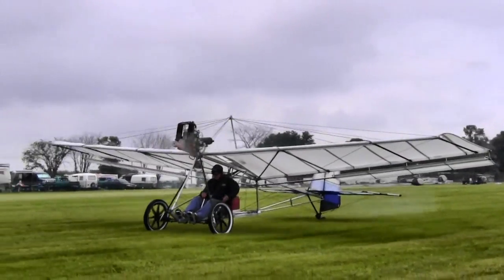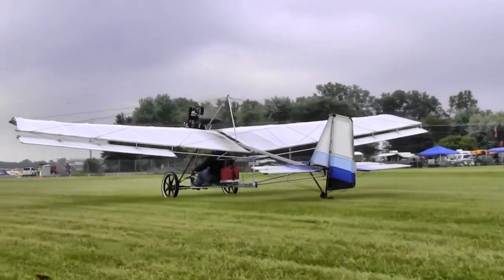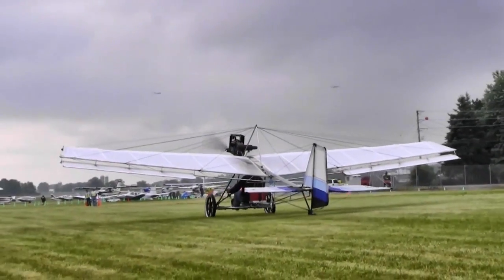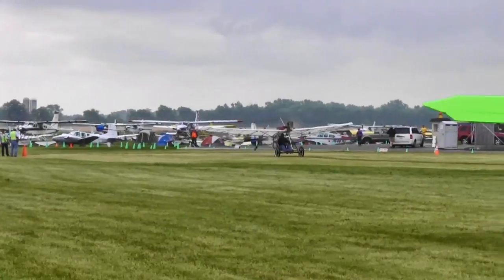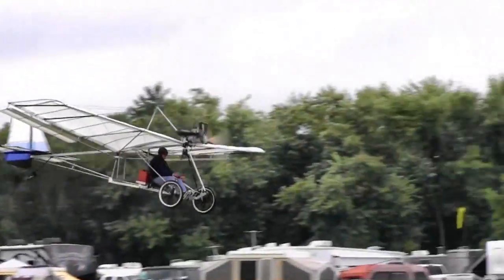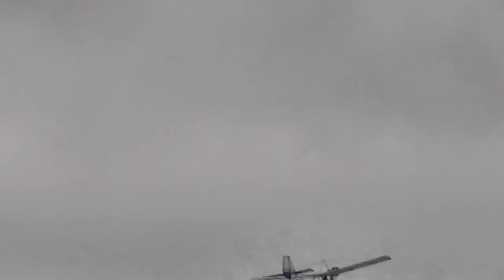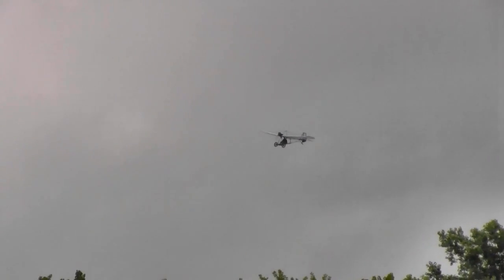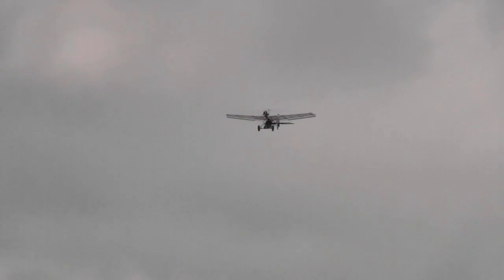You've also got these big, almost motorcycle-style wheels. Actually those are Skyways — I get them from Niagara Cycle. They're Skyway 24-inch mags with fatty tires, which are bicycle tires made for street cycles. The original Robertson B-1RD had 16 or 20-inch Skyway mags as stock equipment; these are the same exact mag but in 24-inch, which allows it to go over big bumps a lot easier. The original suspension on a B-1RD was two and a half to three inches; this one's been increased to eight inches because I've got bigger wheels, so I don't have to worry about banging the keel tube.